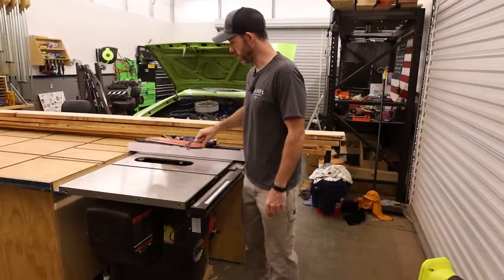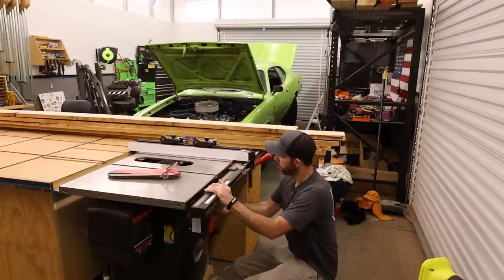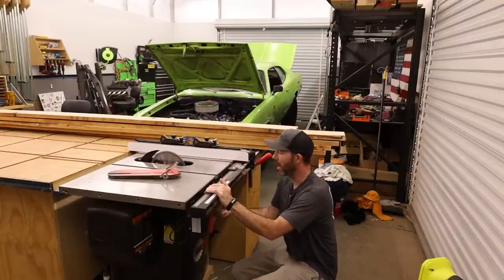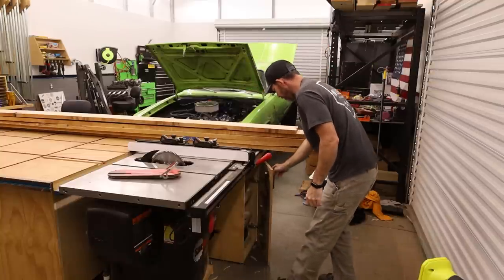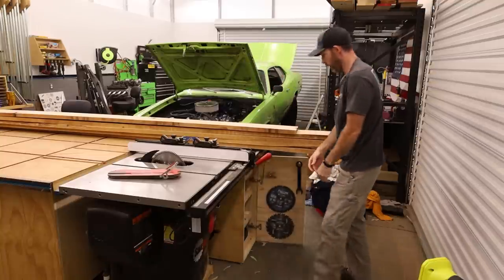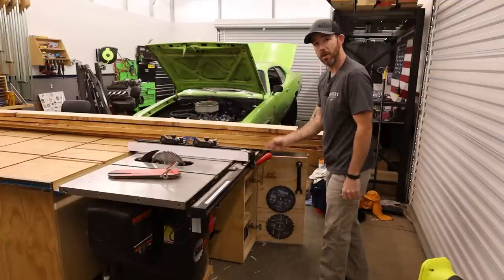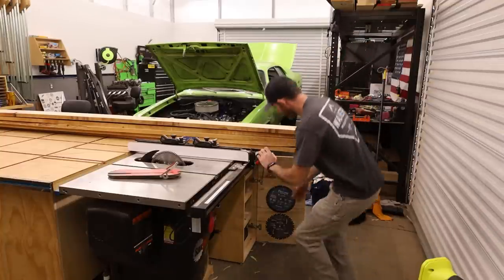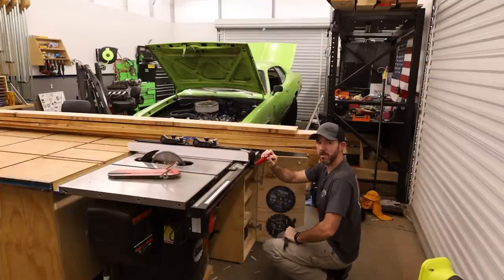Now, first thing I'm gonna do is take this blade out because the one that's in there is fine-tooth for cross-cutting. I used to not spend the time to change the blades, and then I started doing it and it makes a pretty big difference. So I got my handy dandy saw cabinet down here, which I have a video on if you guys wanna check that out. I'll leave that down in the description below, but I'll get this changed out and then we'll get to ripping these down to size.